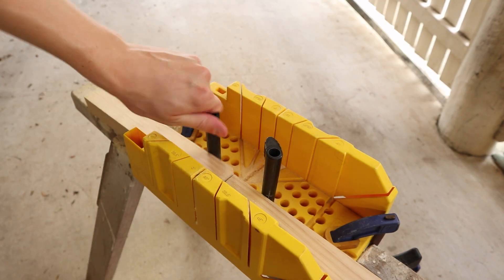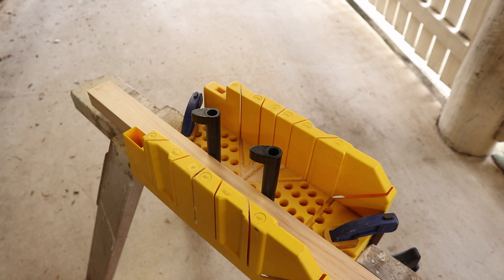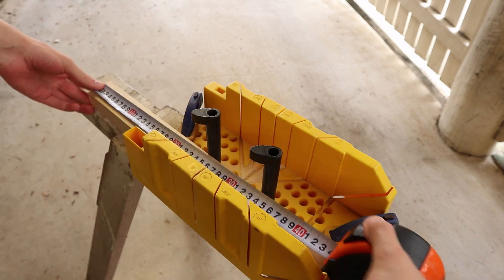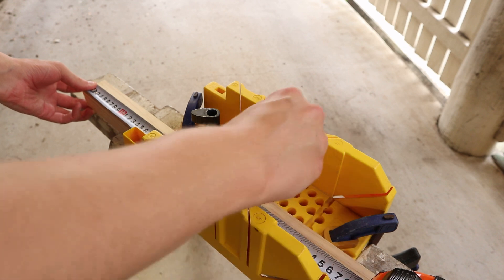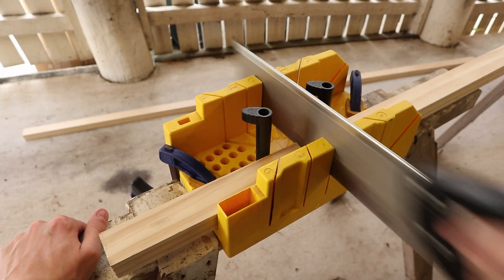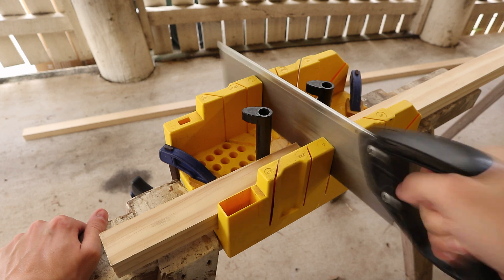So before we take a look at what you can do with a 10-inch server rack, we've got to build it. For this I purchased 4.8 meters of 42mm by 30mm pine in two equal-length pieces — a bit more than we need, but it's what was available locally. I'm not entirely sure what the equivalent timber sizes in the US would be, but you could probably use 1x2s and adjust the dimensions to suit. If this were a full-sized rack build, 2x4s would be appropriate. I paid the equivalent of 24 US dollars for the timber, which is as high as it is because I bought the more expensive pre-planed stuff that needs minimal finishing work. It is of course reasonable to just go with regular timber and optionally sand or plane it yourself.